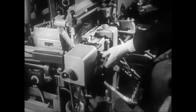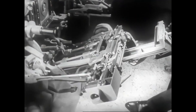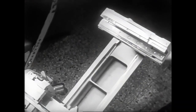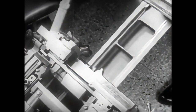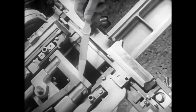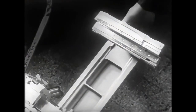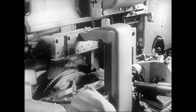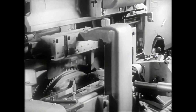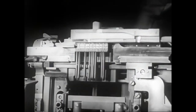In front of the mold disc, there is the vise frame that can be opened when necessary. Important parts of the vise are the first elevator, the vise jaws, the justification block, the knife block, and knives. The first elevator jaw is so arranged as to receive the line of matrices from the delivery slide and to lower the line between the two vise jaws.